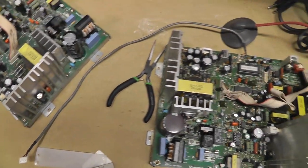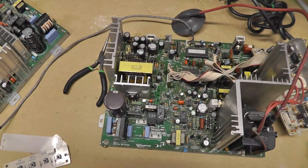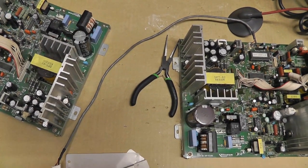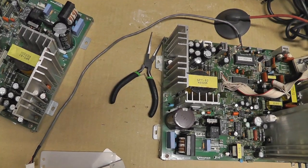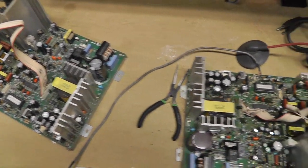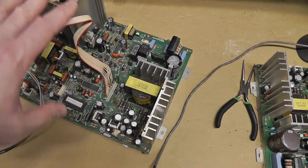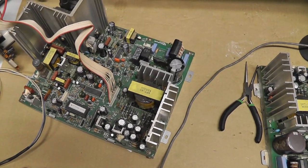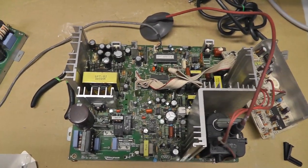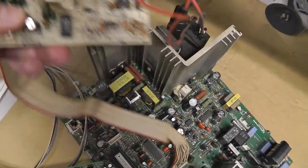The other thing I brought up on Klov is powering these up on the bench. A couple people said that when you don't have it hooked up to a yoke, you can potentially cause problems with the horizontal output or something like that, that it could end up stressing some circuits and blowing something. So I'm not going to power it up on the bench yet. I'm going to put my known working, or was working anyway, chassis back into the monitor. I'm going to try my remote board again and see what we get. And if not, then I'll come back to troubleshooting it, because I know we were looking at that chip on the neck board and not getting output on pin 10, but I don't know why that was.